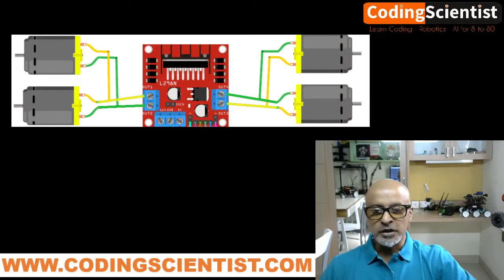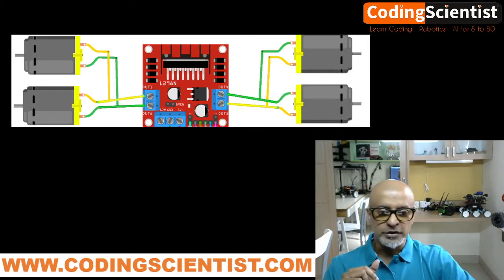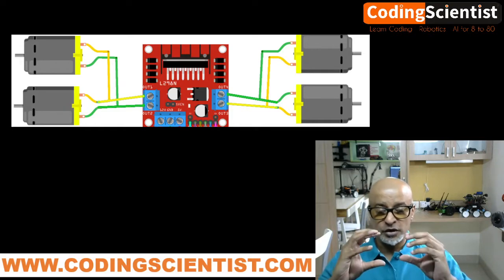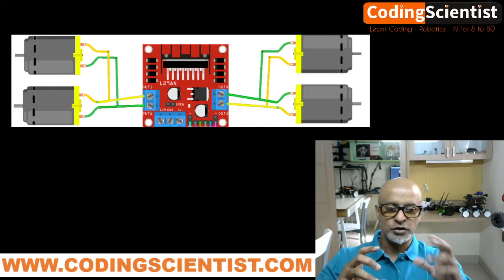So if you look at the circuit drawing, two of your motors are connected to the left side of the motor driver, okay, and two of your right side motors are connected to the right side of the motor driver. Now the way it works is two motors you need to make work parallelly and then connect another two motors to work parallelly.